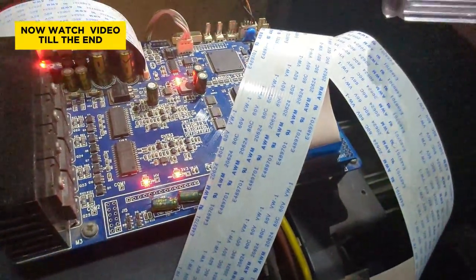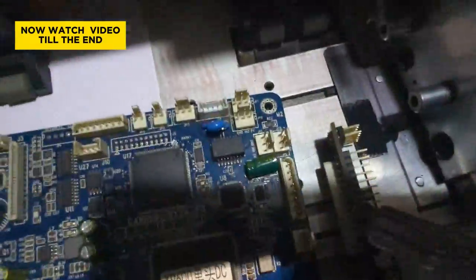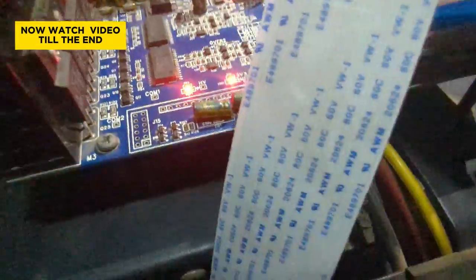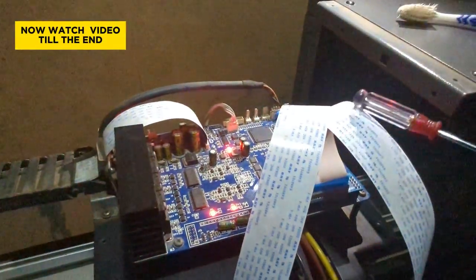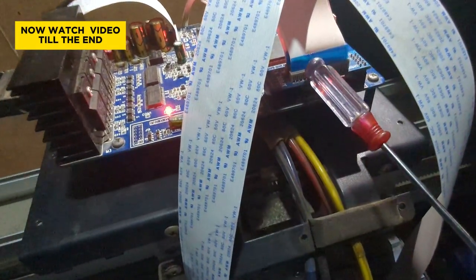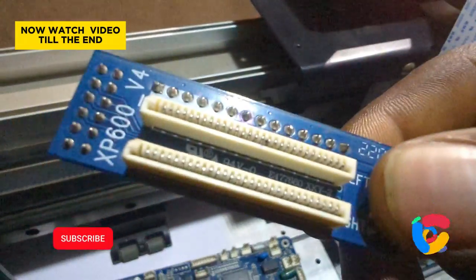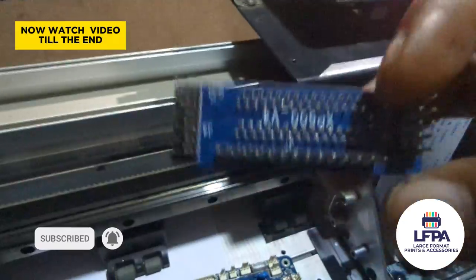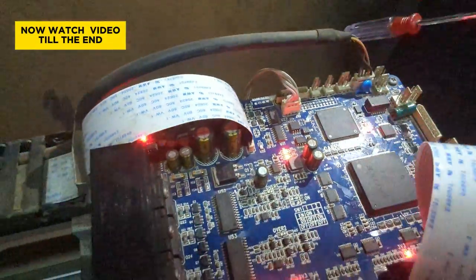This cable is the printer head cable, and it connects to the board via this adapter card. Make sure your machine has this adapter card. If you suspect a cable problem, also check this chip — though it scarcely has problems. Look for splurges of ink around the chip on the front and back. If you don't see those symptoms, you're probably not dealing with a chip problem.